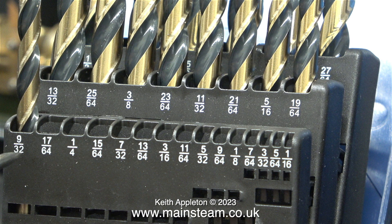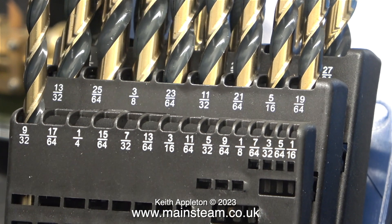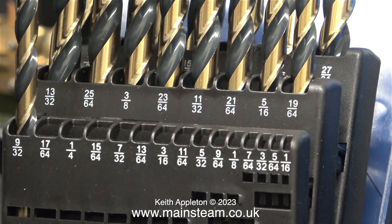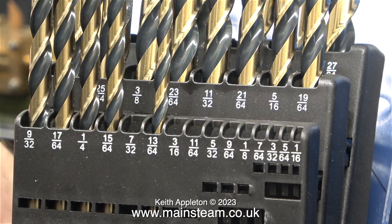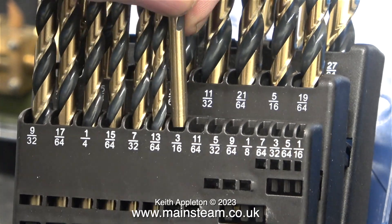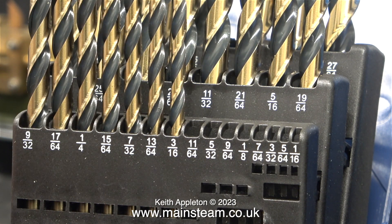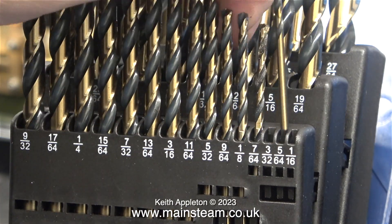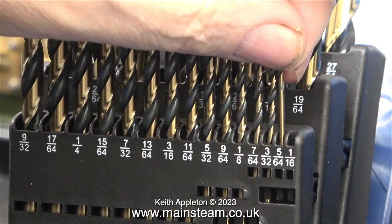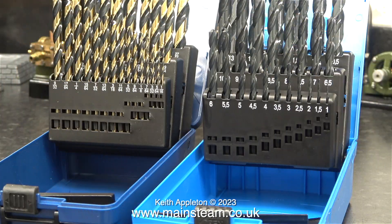I don't want to get the fingers of all the expert trolls twitching, so all I can really say is go online and download a chart — then you can use exactly the right size of twist drill for a tapping size hole for any given size of tap. I will continue to do it the way I've done it for years because it works for me. I've made quite a lot of things and nothing's fallen apart because the threads have been wrong. Here I'm putting the twist drills back in the box — they will only fit in the hole they're supposed to fit in, so this box is quite a good gauge for drill sizes.